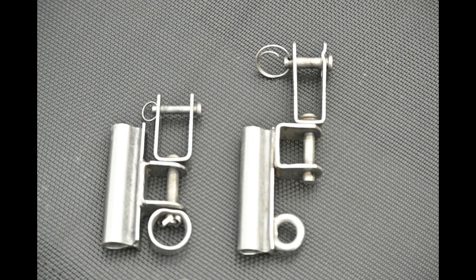On the left is the Hobie gooseneck and slide. I just got this on eBay, but they still sell them new, and I'll put the part number in the description. It fits exactly the same — it goes in the luff track and the mast exactly the same as the old one. The slide part is exactly the same size, and it's easy to adapt it to your existing gooseneck on your boom.